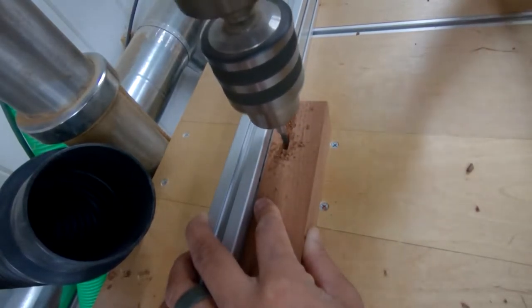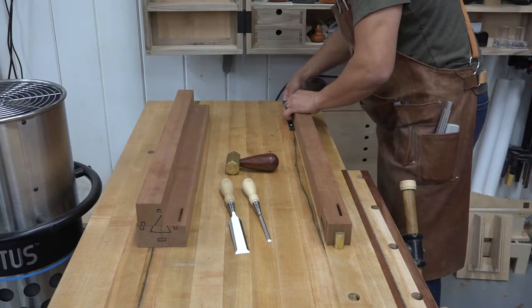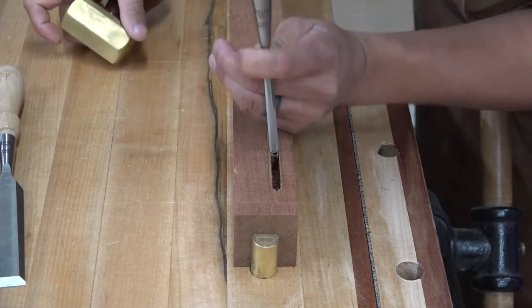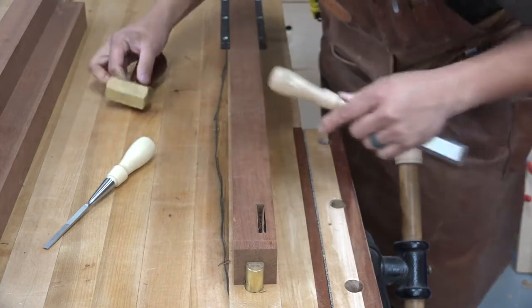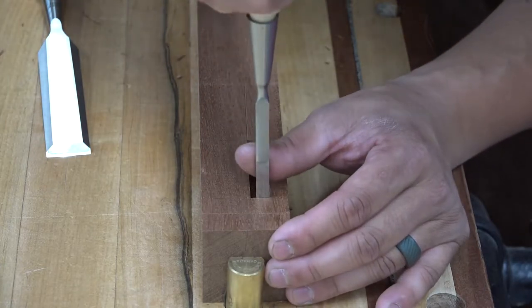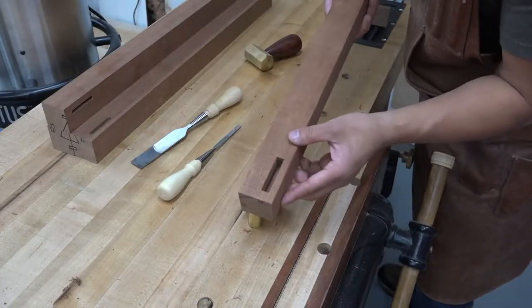I then bore between those two bounds removing as much waste as possible. At the bench I'm using my inset tail vise to clamp down the legs. I first chop down the shoulders of the mortise to sever the cross grain, which ensures that as I chop along the cheeks, the grain fibers don't splinter off and mar my well-defined shoulder lines. I'm always chopping half the distance to the scribe line until I have no choice but to bury my chisel into it, because the resistance from the waste material can push against the bevel of the chisel and make the mortise wider than intended. And there you have it — a clean mortise machined with the drill press and chisels.